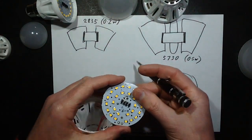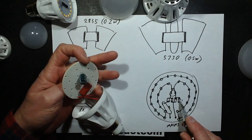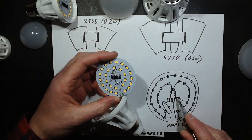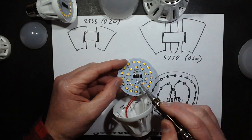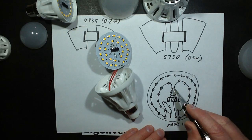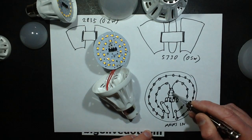The arrangement of the circuitry inside — for some reason on the bigger ones the mains comes in on the edge and goes in between the LEDs with the capacitor jumping across to a bridge rectifier. The two outer diodes are connected by a central track, and the two middle ones are connected to typically neutral. They're connected as pairs on the other side, and the pairs go straight to the electrolytic capacitor and a tiny resistor for discharge, with a matching resistor here for the current limiting. Then, because the mains comes in from the edge, the LEDs go in a horseshoe shape — jumping down and back through all the LEDs, then back up again, missing the mains terminals, and returning to the other side of the capacitor.